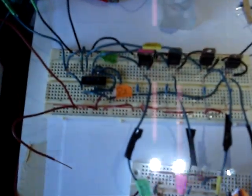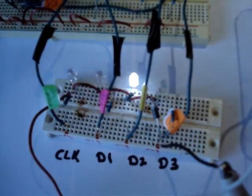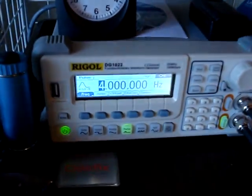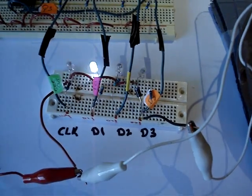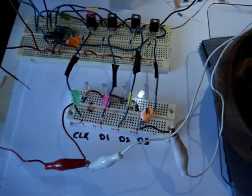There's the 74LS175. We'll dial down the frequency so that you can see them working at a little bit lower frequencies. So you can see at 4 Hertz, we have the clock and then D1 and D2 for the drains of the MOSFET circuits. It will work at just about any frequency. And here's the schematic.